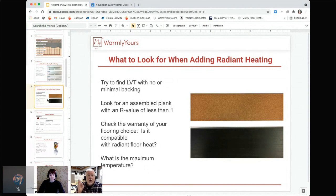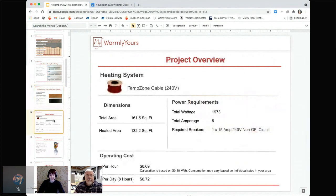Electric floor heating lets you keep it right at that temperature — no overshooting or undershooting because it's in the self-leveling — so it stays right where it needs to. Ask the maximum temperature, ask the maximum deviation, and how many degrees north or south of that temperature it can go per day. Those are the things you want to learn as an informed consumer so you can go in knowing exactly what you need. A lot of people just pick their flooring type or color without looking into some of the logistics — so it's really something to keep in mind.